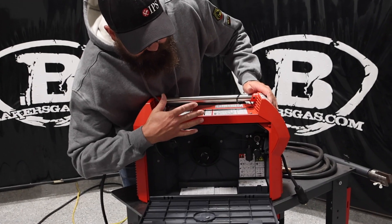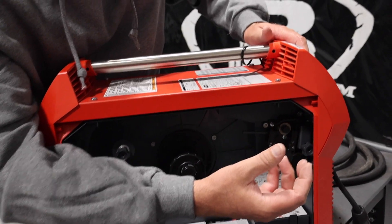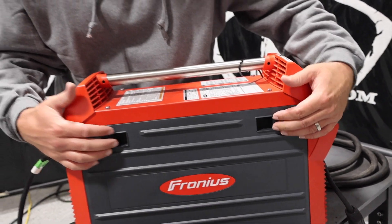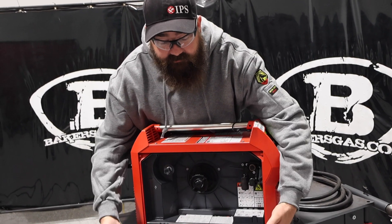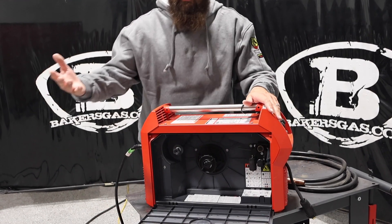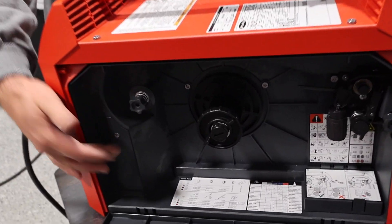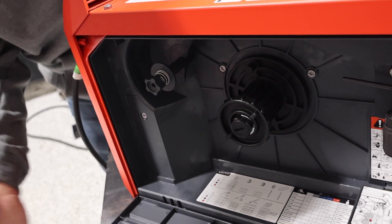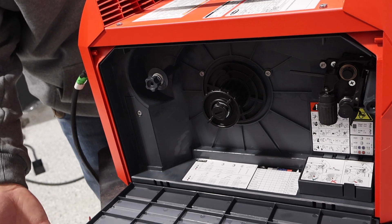What I like about this unit — it's all enclosed, easy setup on everything as far as drive roll systems. You can change those wheels out, it's very easy to do. The biggest thing we get questions about is how come I can't open it — well, you've got to open it with two hands to get it open, you just pull it aside and it unclicks. Another question we often get: what's in here? This is actually a fan motor — the fan inside there cools the internal components on the machine. We haven't seen any come back for a bad fan, but it's just an easy access to get to that fan if it does go bad.